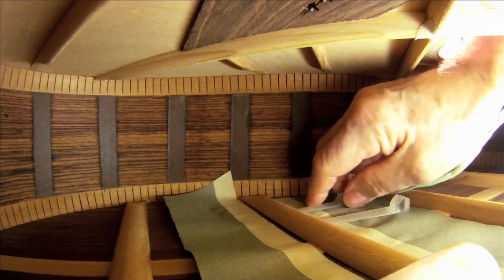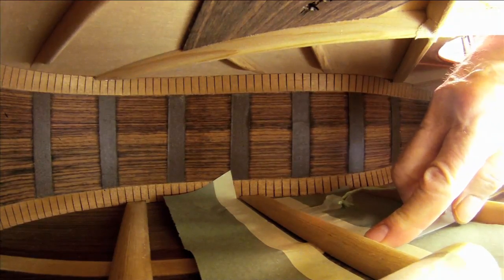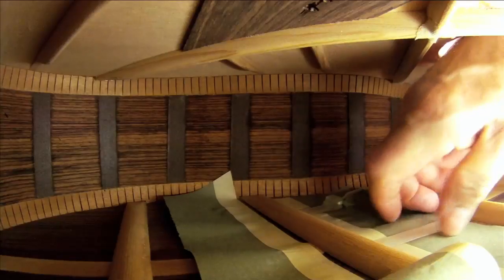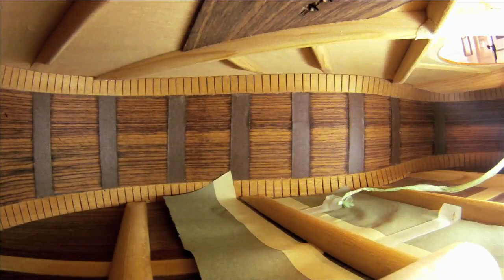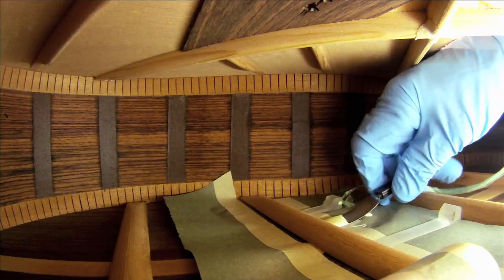Something that's really important are wedges. That's 1/2 inch thick acrylic, bandsawed down and filed to shape. The lug on the end gives me something to hold on to. And I use the wedges when I'm gluing. Everything's clean, I'm ready to go. I'll shove the wedge in, 2 or 3 of them, down the length of that brace so I can get in with a whole big glob of glue and have easy access.